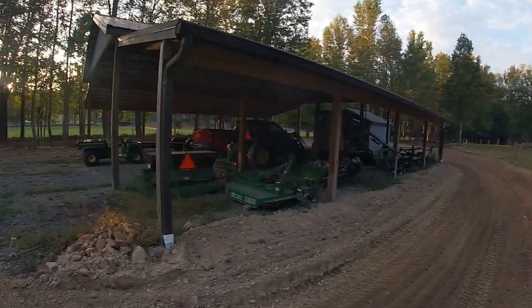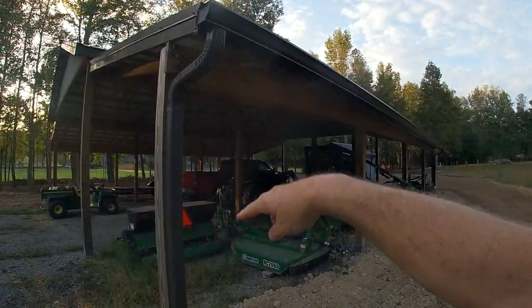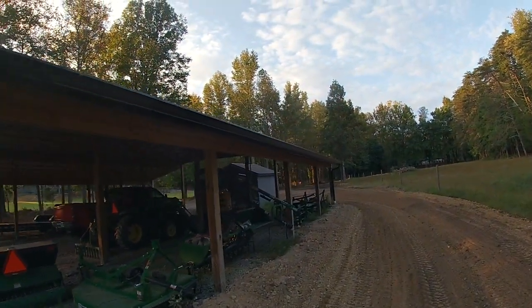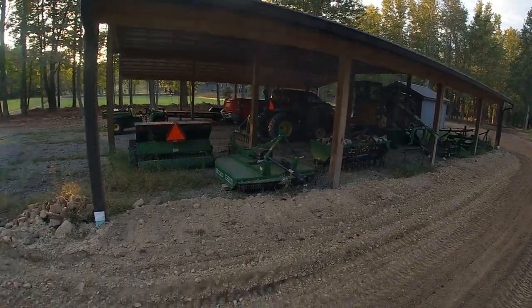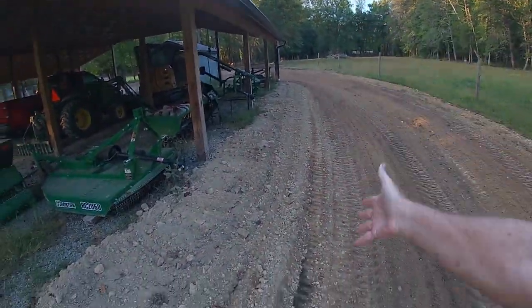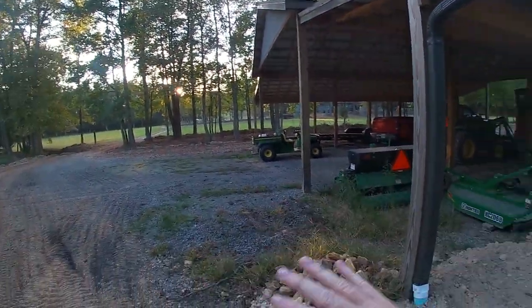So anyway, guys, for the gutters, we went with the jumbos. Got two big oversized downspouts to handle the water that's coming off all of that roof line. And then we have run these down in the ground. I dug, as you saw, the main trench line, and I've got them run over, and they're feeding over to this ditch. So this will stay dry.